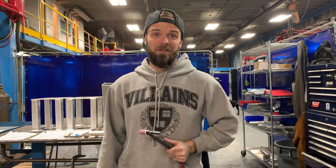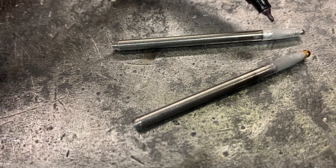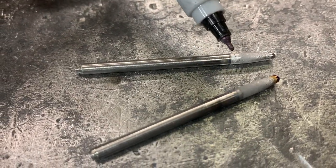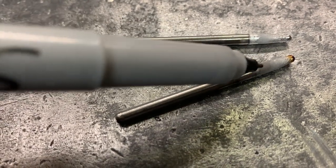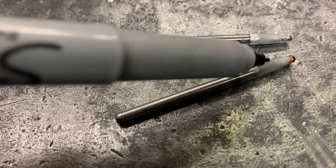Please change your tungsten — don't even bother trying to do a weld, especially if you're learning. As you can see in this clip, I've got a couple tungstens that have just been dipped. If you look at them, you can see a little band of contamination collected in a couple spots. You might see some contamination right around the ball near the end, or about a centimeter up around the cup line. This will mess your weld up — either causing contamination from material sparking off your electrode, or causing your arc to wander all over the place, which is going to drive you crazy.